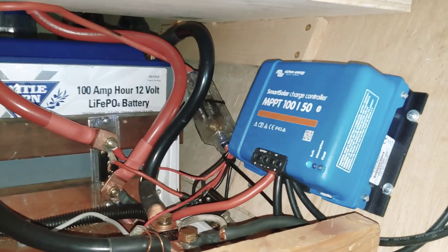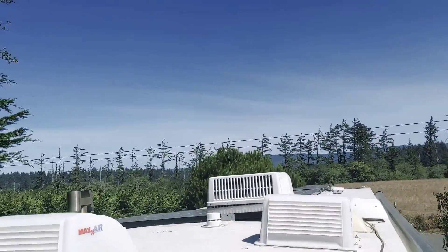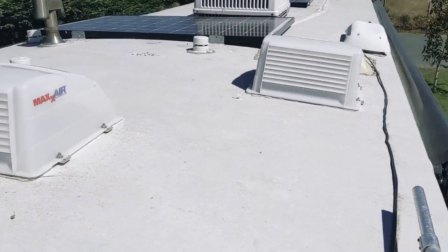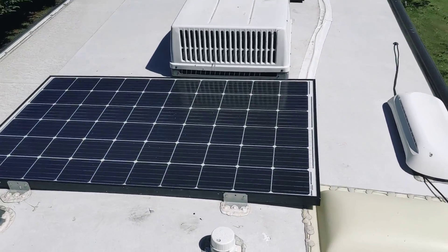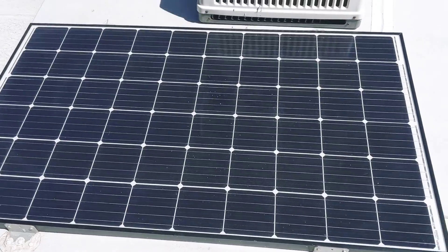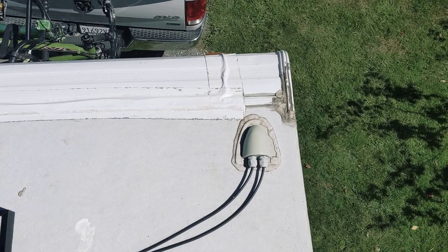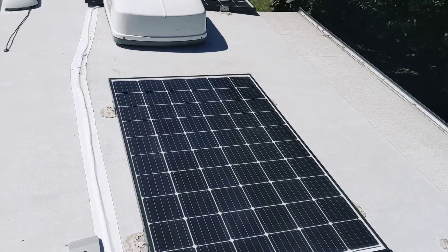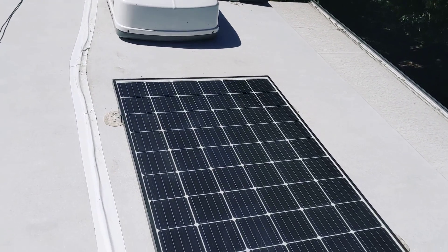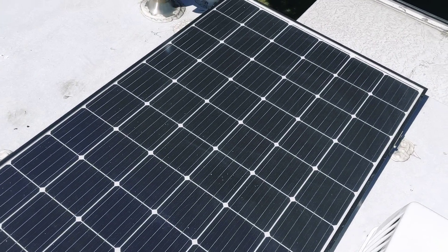Now let's go take a look at the solar panels on the roof — not easy with one hand. Here's the roof. Sorry about the wind, but we've got actually residential-size panels. These are 300 watts — one, two, three of them — and they come over to this junction here, which I installed. Those positives are what you saw down below. They're all wired up together and have full sunshine here. That's why they're pulling in about 41 amps right now.